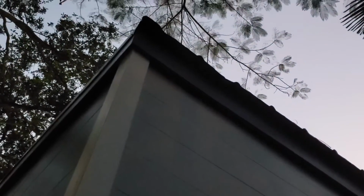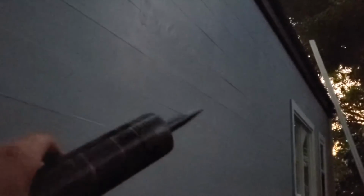Traditionally, drip edge is installed mechanically on roofs. Nails would be used to attach the drip edge. In this case, that would require me to remove some of the metal roof panels to get the drip edge underneath and room enough for a hammer to put in some nails. I don't want to do that. I'm afraid that could cause more harm than good by disturbing the existing roof and the sealed screws.